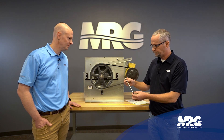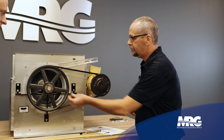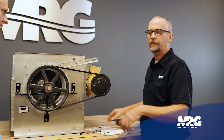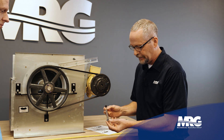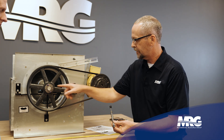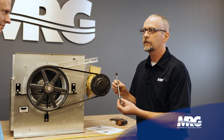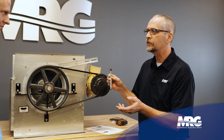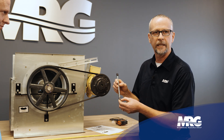When I use this tool there are a couple of things I have to set on it first. I take my tape measure, center point to center point — I come in right at about 16 and a half inches. So I'm going to round that up to 17 inches. You'll notice on the tool you have two O-rings. The O-ring on the bottom is where you set the distance. Each one of these lines is in increments of 10, so this is not a super precise tool. You're never going to get that little O-ring to read exactly 17 — I'm trying to get it as close as I can, right below what would be the 20-inch line.